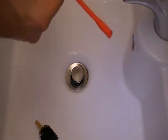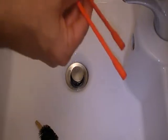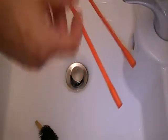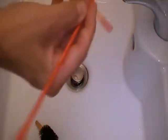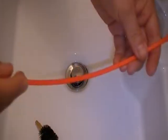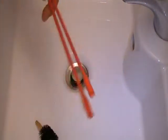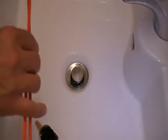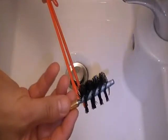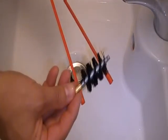We're going to use the following pieces to help unclog a common sink problem: hair in the sink. We're going to use the Millie Rod Polymer Series. The pieces I'm going to use today are the Round Red Rod, which has some flexibility, and the Superflex Flat Rod, which will hopefully go around the corner. I'm also going to use the standard hook and the small brush. So these are my tools, and you're about to see my attempt.